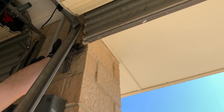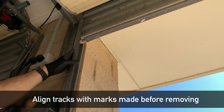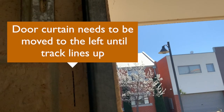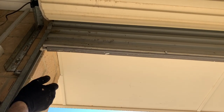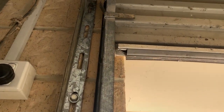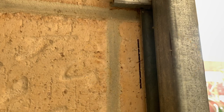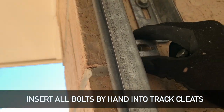The left hand roller is completely fine — it obviously favours the right hand track, which is normal, so we'll leave this one alone. I probably should have put a little bit of silicon spray in that one, but I'm doing the video so I probably forgot — I'll do that tomorrow maybe. The door hasn't lined up with the line we put on the wall just yet, so we're going to have to wiggle this curtain over to the left about 15 to 20mm until the track lines up with our mark. Then we can get to fixing the track back onto the wall. That's ended up exactly where we want it — now we'll go through and put each bolt in the track cleats by hand and then tighten them up with the impact driver.